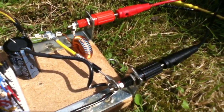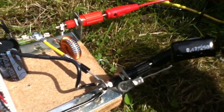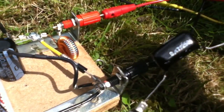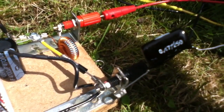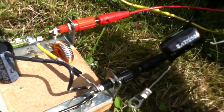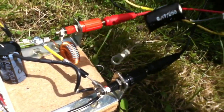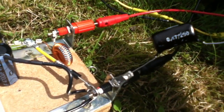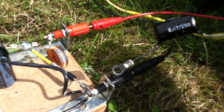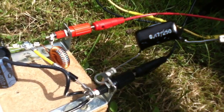To address that, I'm going to fit a 470nF polyester capacitor directly across the battery terminals to see if that helps. I don't think it needs a huge electrolytic. I'll see whether the inductor runs a bit cooler without putting the scope on it yet.